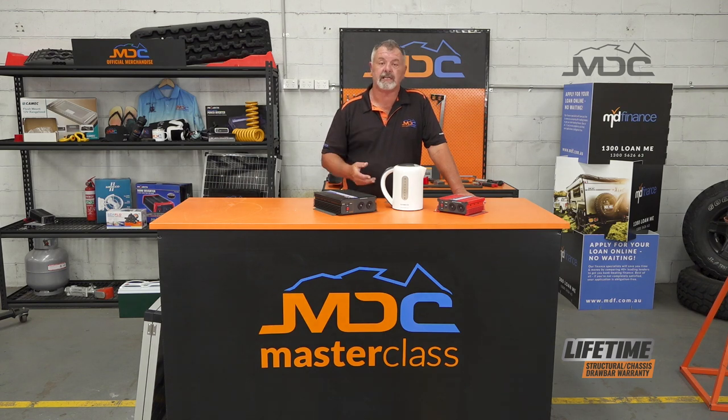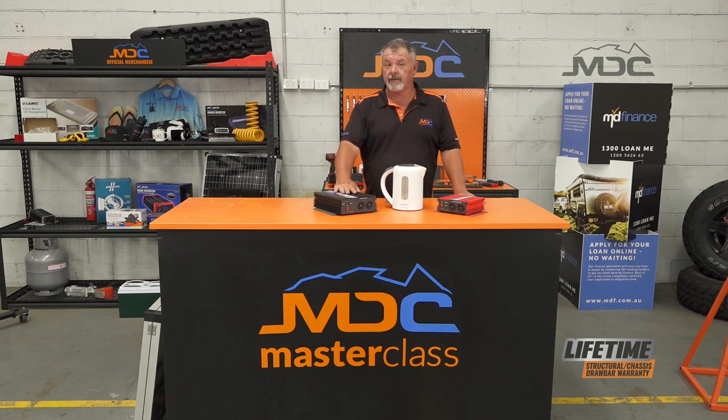If you're running sensitive electronics, maybe a CPAP machine or something that requires good quality pure sine wave, that's what you need to acquire. If you're purchasing an MDC caravan or camper and you have a specific need for a pure sine wave inverter, you need to make sure you tell the salesperson at time of purchase you want to step up the inverter in the camper or caravan to a pure sine wave. Generally, they'll come with a modified sine wave, which will cover 95% of the applications.